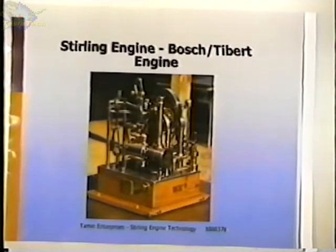The disadvantage with low temperatures like that, if you want to produce any kind of usable power, is that the engine has to be large, and that may not be a disadvantage in some places. If you really just want to generate power in a stationary location, you've got a lot of space. I recently did some calculations. I had a call. Somebody had some water that was almost to the boiling point, and I think it was from a solar collector or something, and they told me how many gallons per minute they had, and I went through and did the calculations on it, and for 200-degree hot water temperature and say 50 or 60 degree cold end temperature, came up with an engine that would have a 15-inch bore and a 15-inch stroke, a four-cylinder engine,